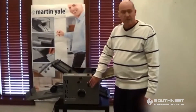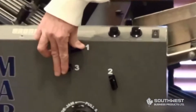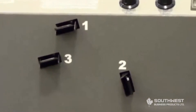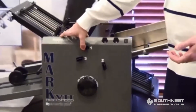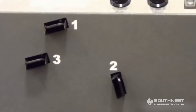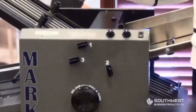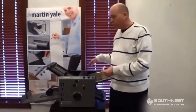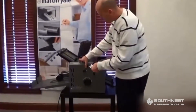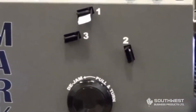You might notice these little tongs on the side of the machine. These are actually the type of feature you see on high-end floor model machines found in print shops — they are used to adjust the gaps between the rollers. They are spring-loaded, as you can see by lifting them. Depending on what paper weight you are running, you take a piece of sample stock — for a letter or Z fold, the first roller gap when the paper enters the nip is the thickness of one piece of paper. You tear a strip to that size, lift the tong, and slide it in to set that roller to the correct thickness.